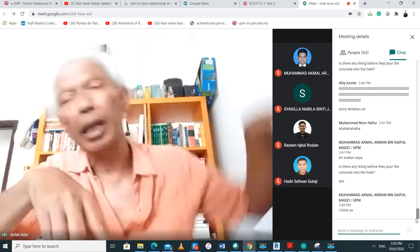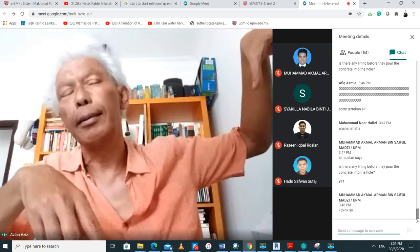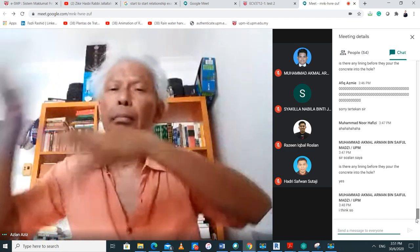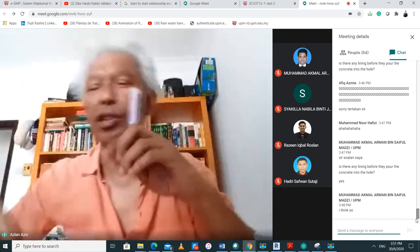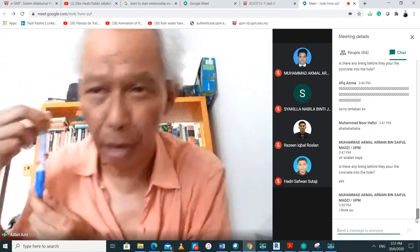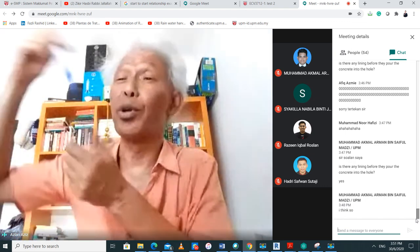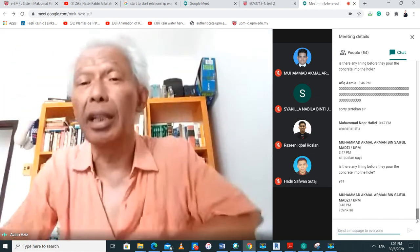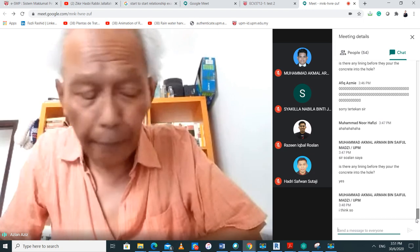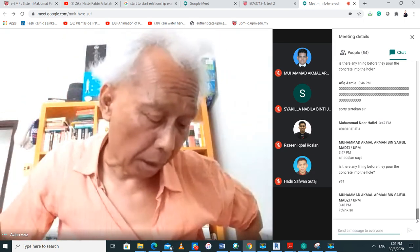So at one end, you have large displacement, which is to do with driving the pile. Bang, bang, bang, bang. Too much displacement. The other end is zero displacement, no displacement, they say. You make the hole first. Then you pour your concrete in. Obviously, there's nothing to it then, right? And in between, you have this small displacement. Okay?